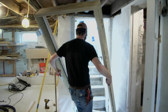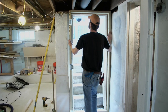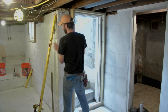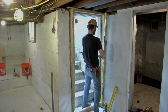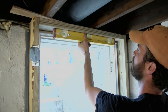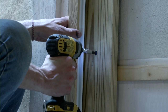While the foam sets up, I install a site-made door frame, which is assembled from 2x6 pressure-treated lumber, and has door stops with conventional kerf-in weather strips to block air flow. The frame is held 2 inches in from the interior face of the basement wall so that it will flush out with the foam that will be applied to the concrete walls later. Then I plumb it, level, shim, and fasten wherever possible — in this case, to the joists above, as well as to the wall on one side, before being locked in with more spray foam.